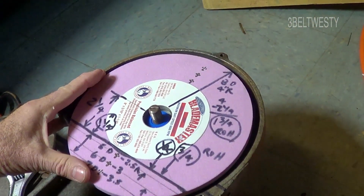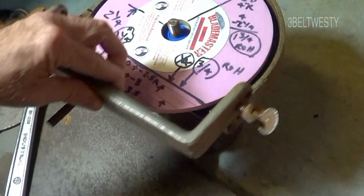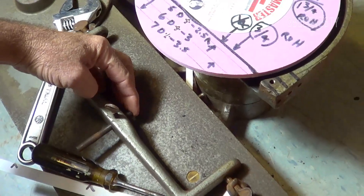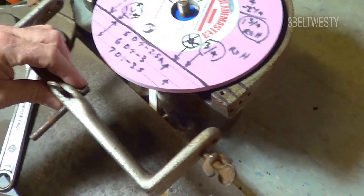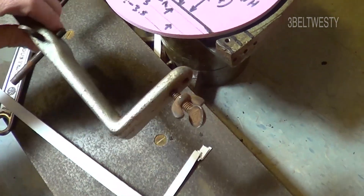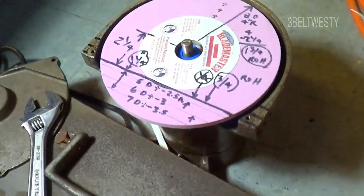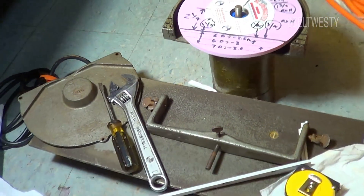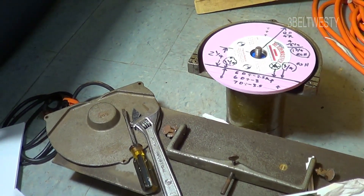The reason I made this video is that somebody on a forum was talking about calculating the radius of hollow. It doesn't matter where you position the arm on the machine — the radius of curvature is determined by the distance from the diamond to the pivot point. You can put the diamond all the way in so it's close to the line of action, but then it has to pivot out in space to cut that tight radius. That's the old S8 — a classical skate sharpener that's been around for a long time with a long service life.